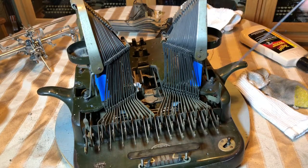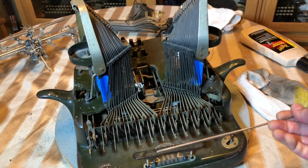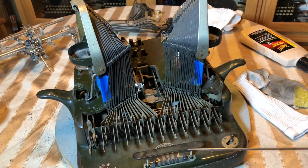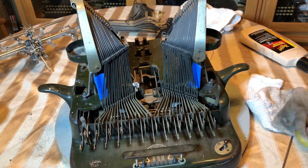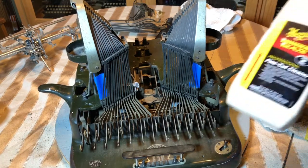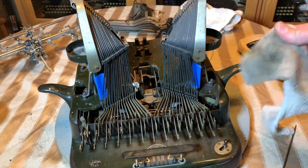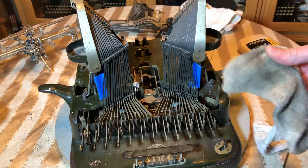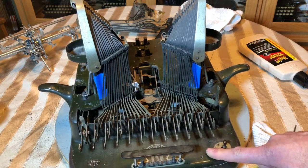It's starting to come together. I've taken a little time and gotten in here with brushes. I've taken the space bar off—underneath those have been taken off to be cleaned. The ribbon reverse, that little plaque, has been taken off; most of the nickel has gone off of that so I just shined it up. What I use on the Olivers is a Meguiar's—seems to work best. I'll put a little bit of it on an old sock; it has enough texture that it gets into any crazing.